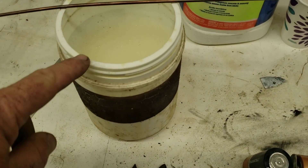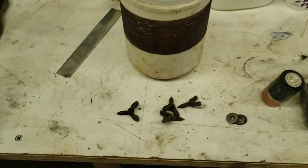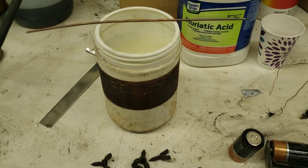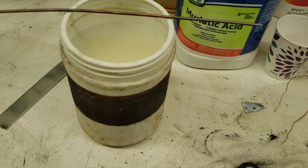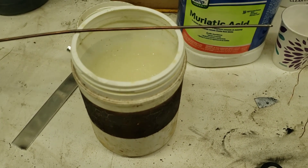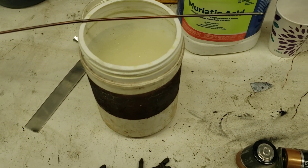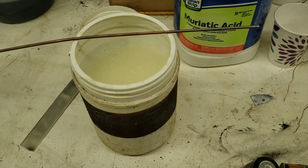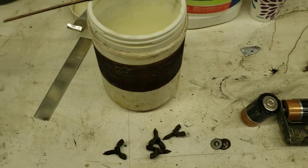This is a solution I obtained from Eastwood. My first kit I made myself - I bought the zinc chlorides and salts and all that stuff, mixed it all together. It's a conductive solution so the electroplating process can work. It's pretty simple, but it's kind of a pain to mix yourself, and buying the chemicals from the supply house cost me almost as much as buying an Eastwood kit. Eastwood and Caswell make these kits. You can get a zinc plating kit from Eastwood for about 75 bucks these days.